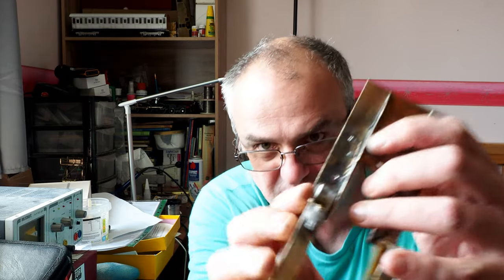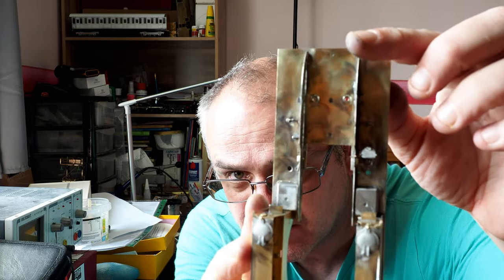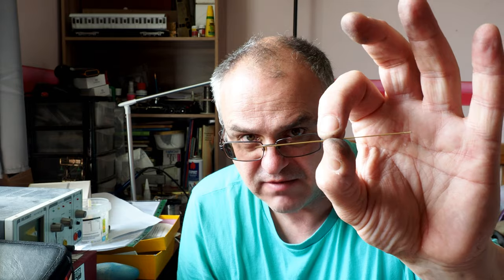I'm back after what was ultimately a little bit of a frustrating session. I managed to lose one of the two smallest castings — L35 — which are the unions for the cylinder lubrication that sit on top of the footplate. So I've removed both of them and replaced them. I had some 0.6 millimeter tube left over from making lamps, so I used that and some wire and 16BA nuts to make a couple of facsimiles which actually look a lot closer to the ones in the photograph than the castings in the kit do — but that's just my opinion.